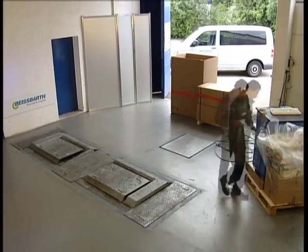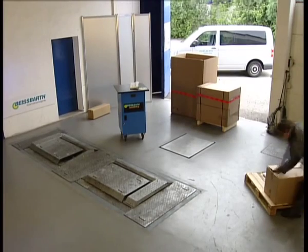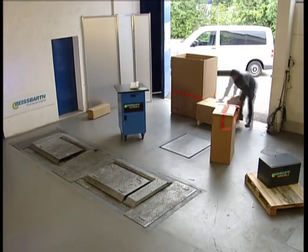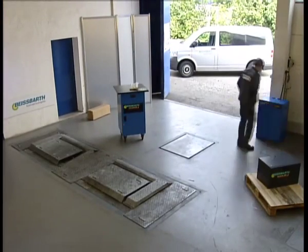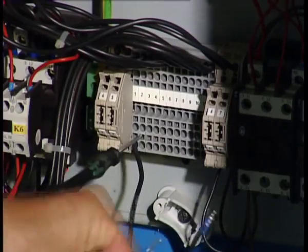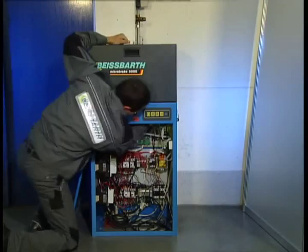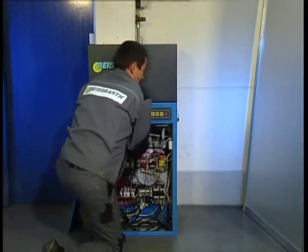The control cabinet with the printer and the PC can now be installed. The electronic and electrical components for all additional functions such as the pit safety system, the weight simulation system, the PC interface, the radio sensor system MRS433, a theft alarm, the roller set heating or the matrix printer have all been pre-installed off works. All that needs to be done is mainly to connect the supply lines for the 12 kW motors including the optional motor brake and the RS485 transmission to the analogue display.